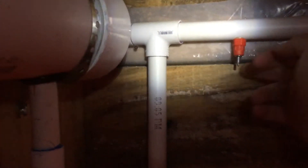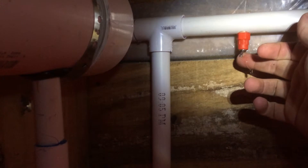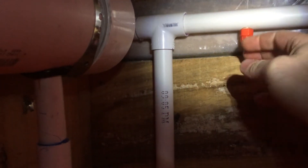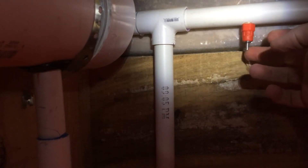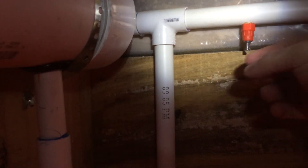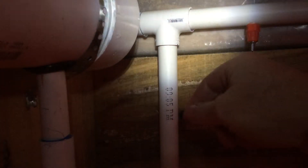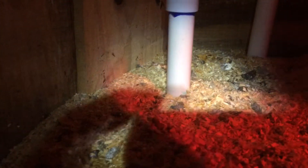What you have coming out this end is low pressure. I can tap these nipples and they just drip real slow. If that was 60 PSI and you tapped it, it would spray out under a lot of pressure. You don't want your birds to peck the nipple and get blasted in the face with water - you want them to get a gradual droplet to drink.